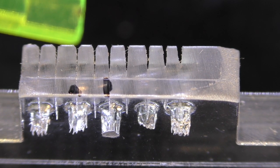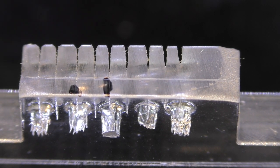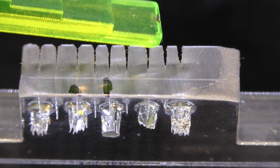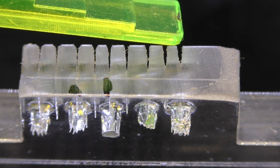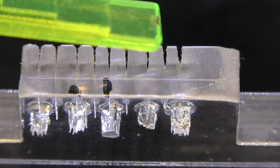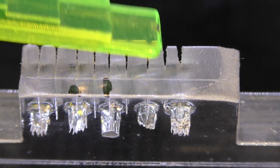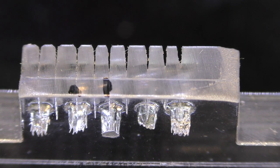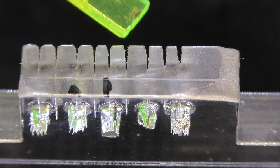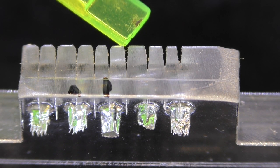This doesn't look like the best focus, does it? Look, it's got a pretty poor radius on the corner. In fact, if we go and hunt for what I previously would have said was the focal point, you'll see that it is probably right the way along here, where we've got a nice sharp corner. We've got no radius on the corner, one of these two. But look at the depth of cut that we get from choosing that as our focal point. You might even consider that one there as being the narrowest line if you looked at it from above.